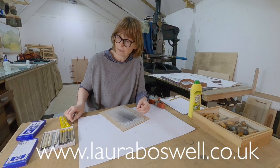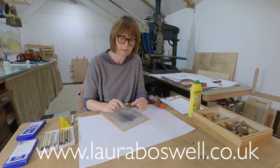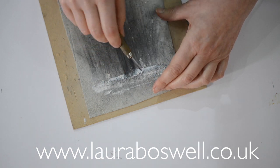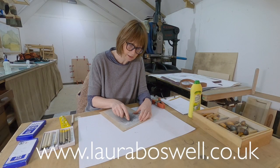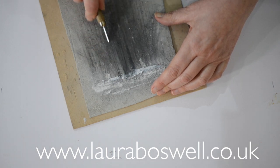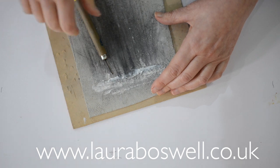With U-shaped gouges, again it's just the outside of the U-shape where the blade is tilting that you're working on. I work down the centre and then the two sides. Mr B has some kind of clever swivel that he does when sharpening these — I haven't mastered that, so I just go in the middle at the tilt of the blade, then over to one side and back, and over to the other side and down. That's how I polish all my U-shaped gouges.